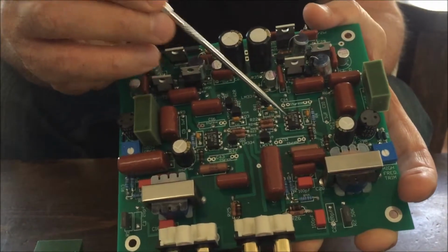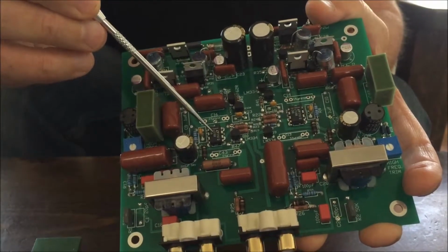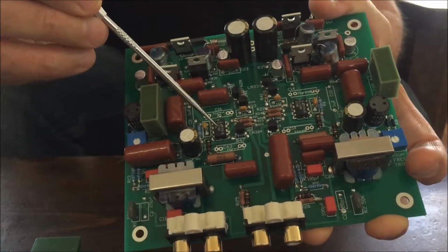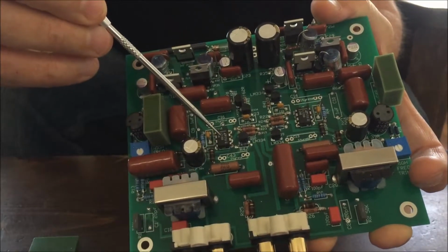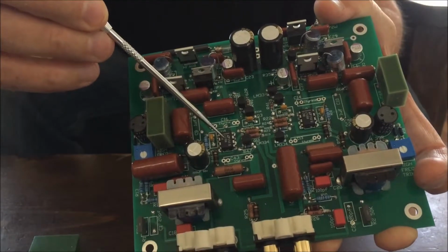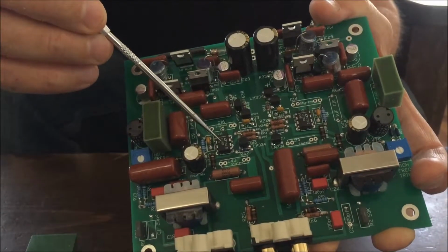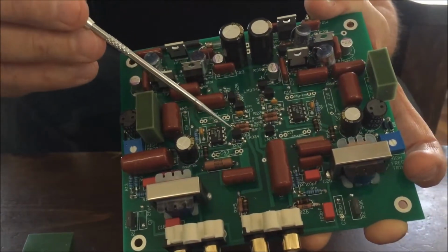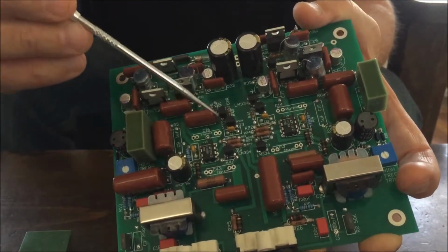These op amps are very high-speed devices that are video bandwidth, and if they're powered right and given good signals, they maintain the front end extension of sounds, the high frequencies, and the leading edge extension of sounds such as snare drums, pop bass sounds, all those percussion sounds that have a lot of attack in them. These op amps are very fast, and they maintain the integrity of those sounds. But what helps them maintain that, in the last part of this circuit that's very important, is our voltage regulation and our power supply shunt regulation.